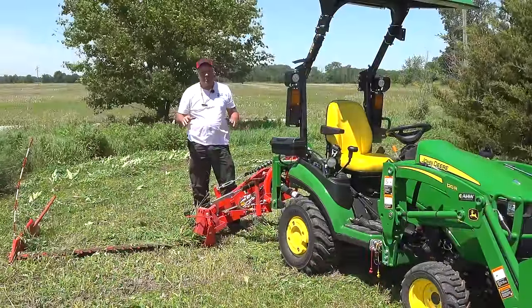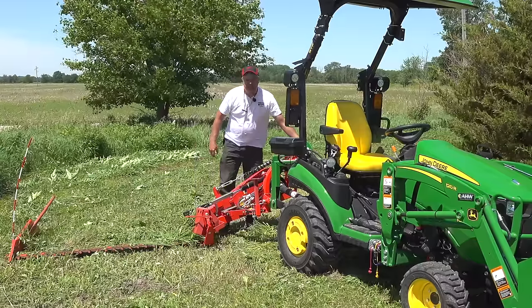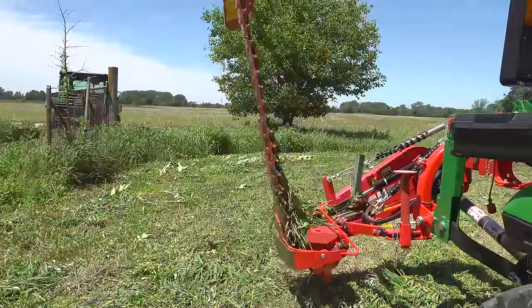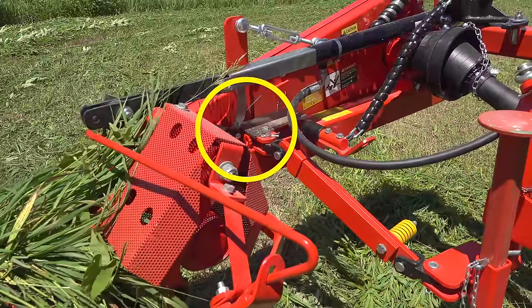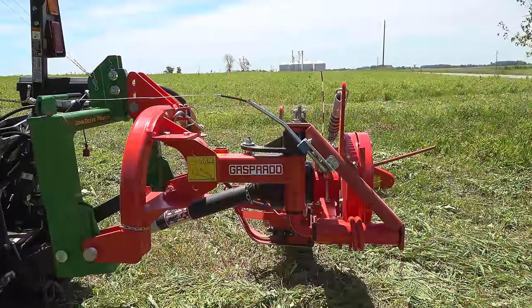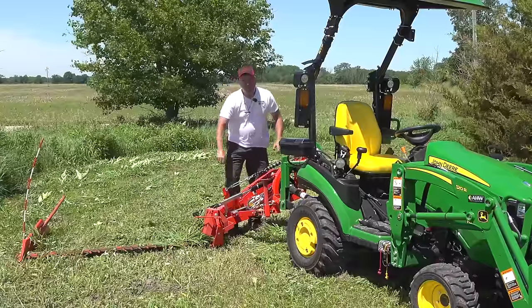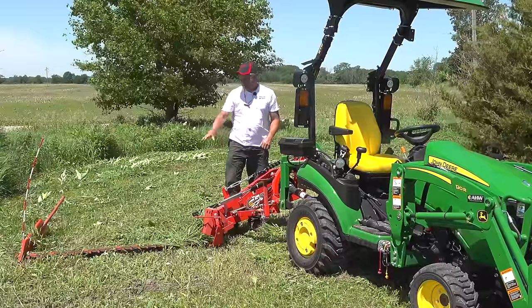I want to give you a more detailed look at this hydraulic lift. This lever here — there's actually a pull cord on the left side of the tractor. When I pull that cord, this flops up, and when it flops up high enough, that's what allows it to rotate all the way to the vertical position. If I don't pull that lever, it brings a bar in right against here, and that's what helps pick up the rest of the mower. The design here is really nifty in how it enhances the three-point hitch. Typically the spring is the only thing that holds it up, but when you pull this tight with the cylinder and keep pulling it, it actually tends to turn the mower and pick up the bar more — and I really like that.